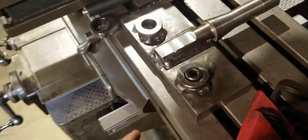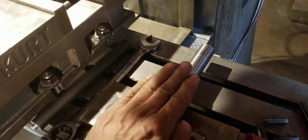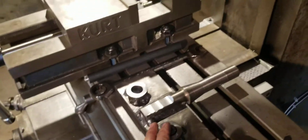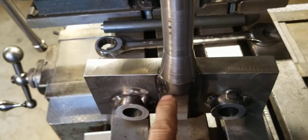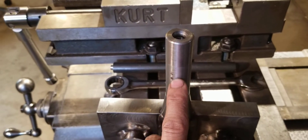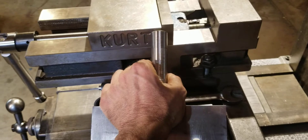I milled a three-quarter-inch channel, set the bar down in the channel — that adds strength and helps center it — then clamped it and welded all the way around. This is about an inch and an eighth diameter; the relief is 0.950 and the other section is 0.940. It's an exact copy of the collet — threads, keyway and all.